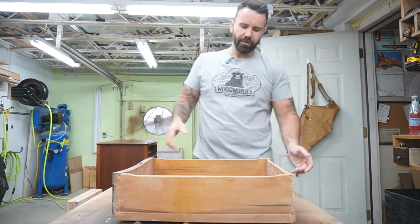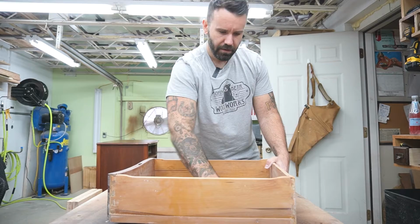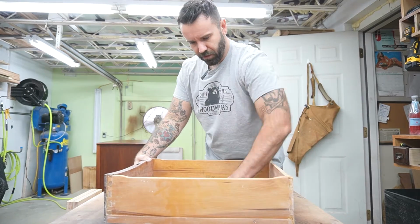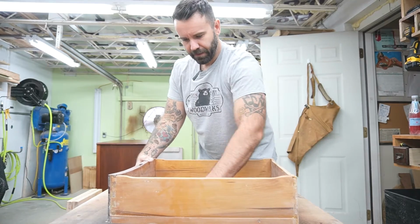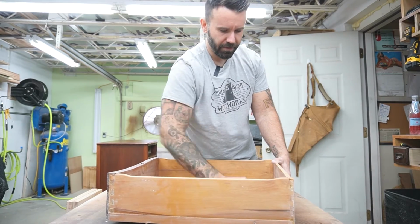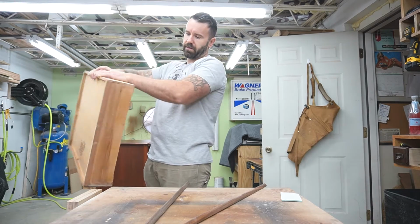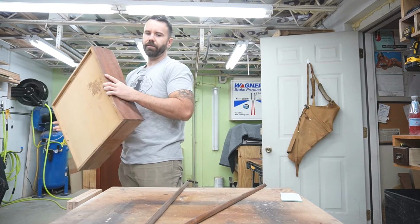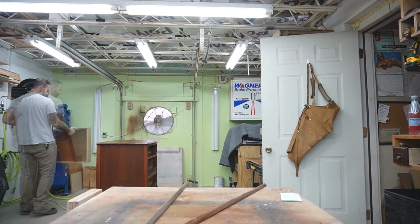And with a piece where you have a lot of mix, the walnut veneer with the maple substrate, you kind of have to tint it a little bit just to tie everything together. If you don't tint it, then you end up with a piece where you can tell everything's a different wood. Things look a lot different. A lot of your factory finishes are very heavily tinted. That's why this finish is so heavily put on there, so opaque, you don't even see the wood.